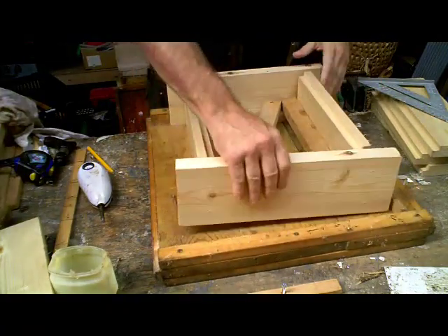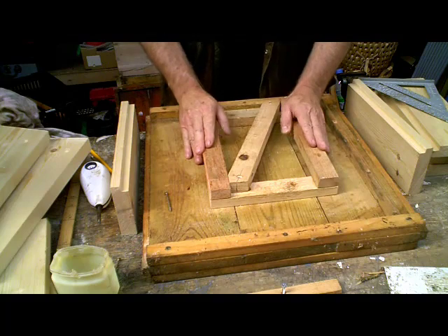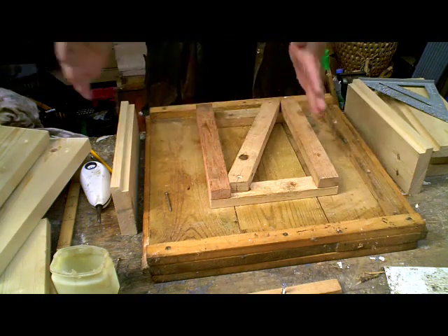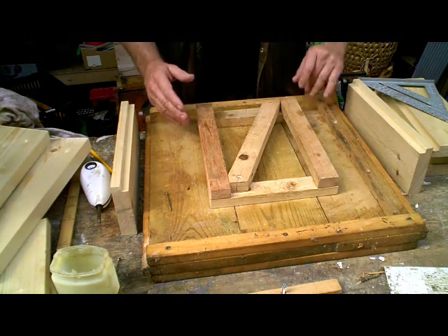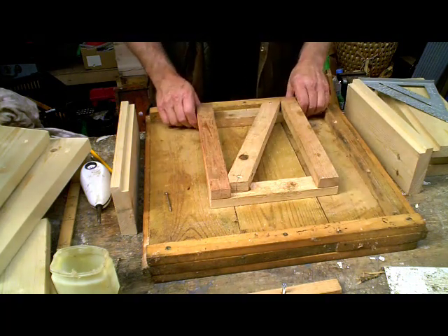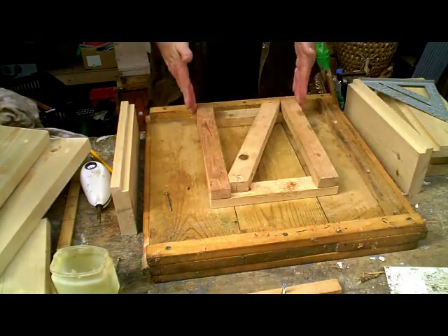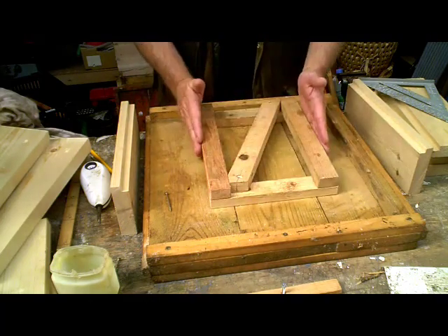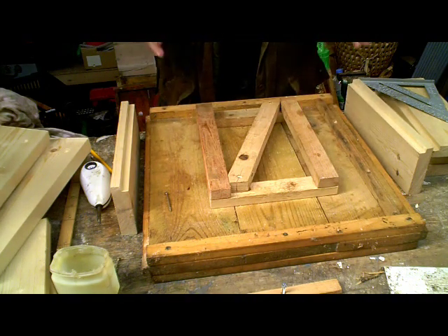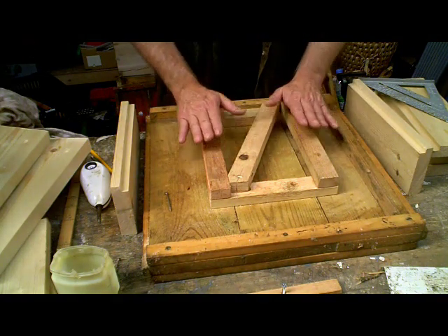Going back to this jig now: the most important thing about using jigs is to double and triple check all your measurements of the original jig. Because if you make a mistake building your jig, that mistake is going to be replicated throughout your entire production line of boxes. So take a lot of care setting this jig up to the exactly right measurements — double and triple check all your angles, make sure you've got nice right angles, and that this dimension is exactly the same as this dimension. If you get that right and spend some time on it, you'll be able to make any number of boxes and they'll all be exactly the same. Even if you come back next year having forgotten the original dimensions, this jig will still be here for you to use.